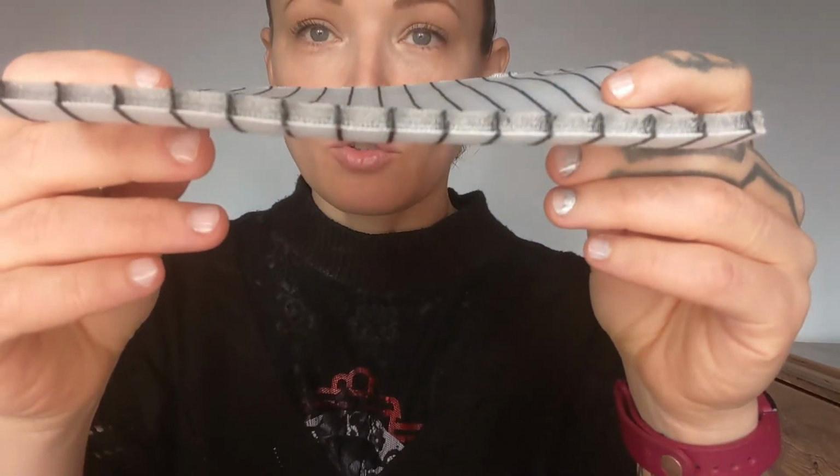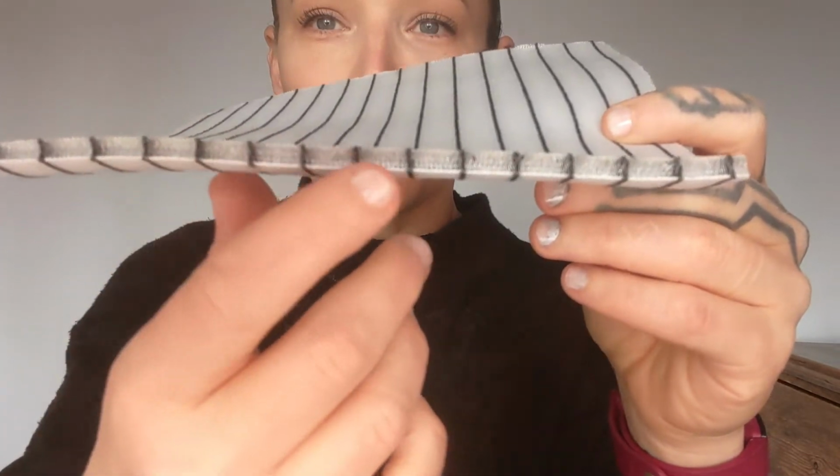So here it is, the magic ingredient. It is a 5mm thick textile that basically goes underneath the Purple-Roof compliant profile. And now what this is doing is, instead of a drainage component basically. So what maybe you can see here is that there are many fibers here going up and down. So now these fibers cause turbulence. As the head pressure rises, the more water you actually have above here, the higher the turbulence will be and the slower the outflow rate will be.